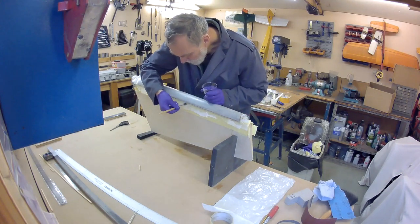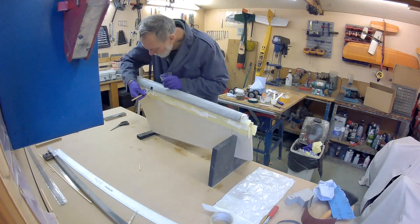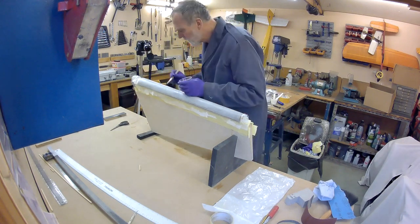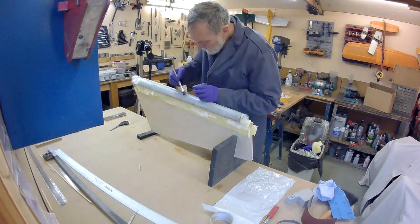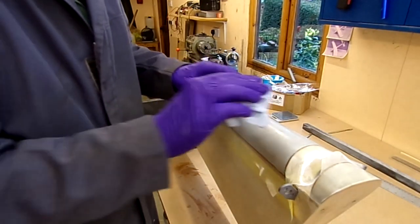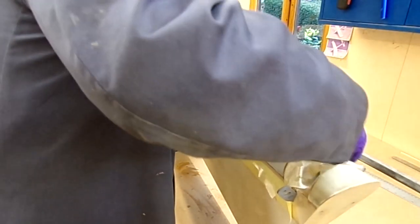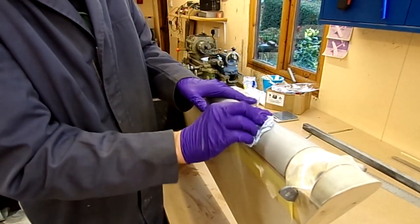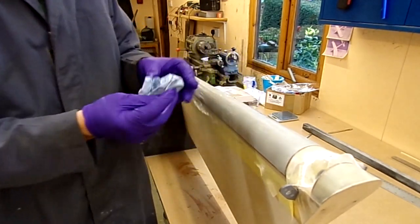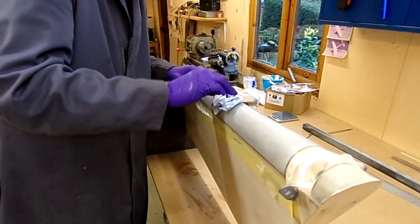The art is to have enough resin to bond the fibres, but not excess resin because that's brittle. So this is to remove the excess resin. I just dab the tissue over, forcing the fibre onto the surface and removing the excess resin. Yeah, and you should have a nice satin finish. Any gloss shows excess resin.